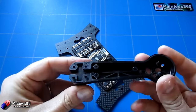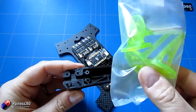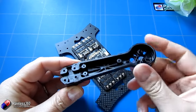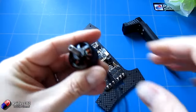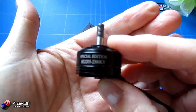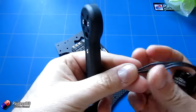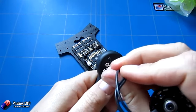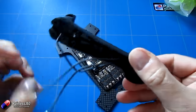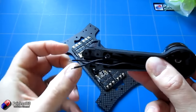The way these arms work on this model is the motor goes on the top, and then you have these big fluorescent feet that go over the end bits, with little carbon fibre covers that go over here. The motors we'll use are the new DYS motors — these are 2205 2300kV special edition race motors. We have to put the wires through the little holes in the arms. It's a little fiddly, but the motor fits on the top of the arm, and the actual cables run all the way through the inside of the arm and pop out at the end.